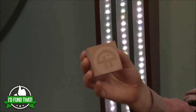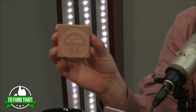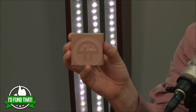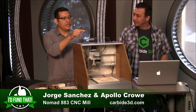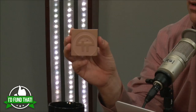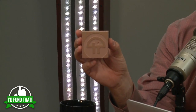There's your logo — it came out great. Three minutes. That's fantastic. One key thing here: we took a PNG image file from the internet, the software brought it in, created a height map, determined how deep to cut, and just went ahead and did it.